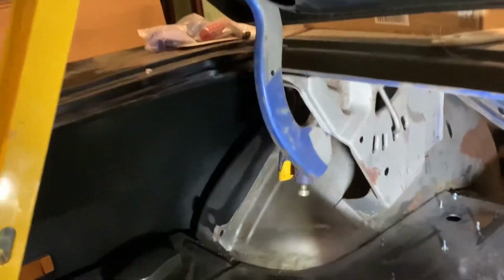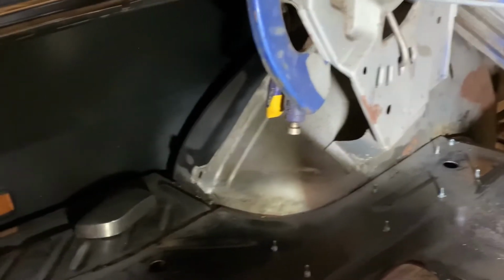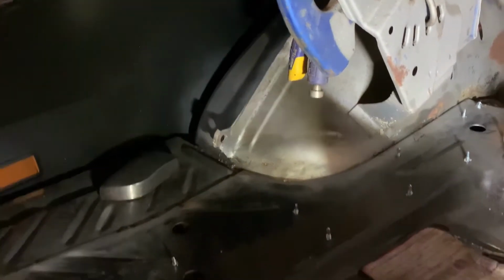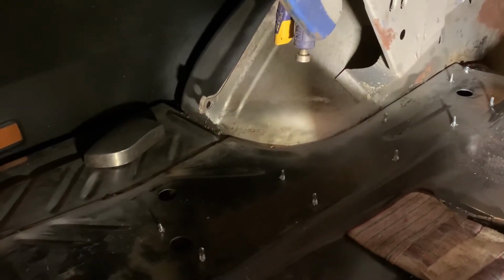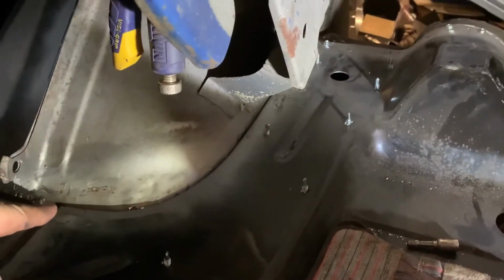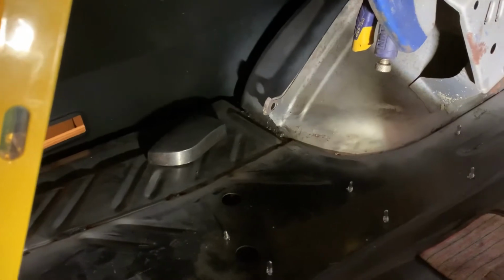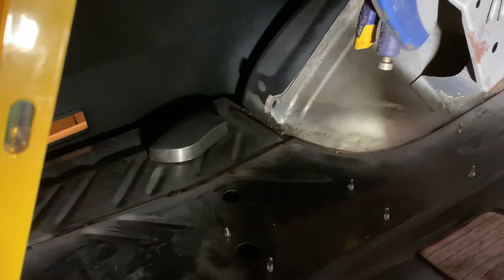So I had to put it on there and brace it against the back of that wheel well and push out to get the trunk drop off, the inner portion of it, to come up where it was fairly even. And then you're pushing down like mad with somebody on the inside with the trunk corner right there. Pushing down and then clamp it, and then I welded it, you know, 3 or 4 spots down the seam. I don't give a rat's if that's what the factory did or not. It works like a champ.